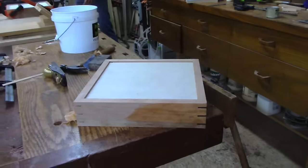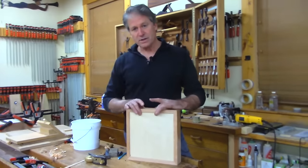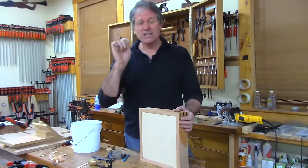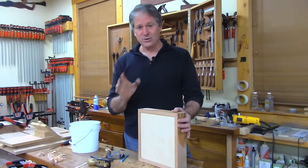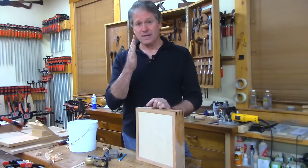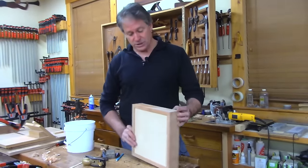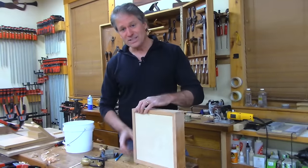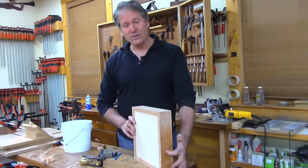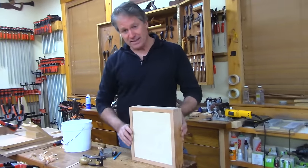Any tips for cutting off the top to make a lid? A lot of times I do that cut on the table saw. I set the height of the blade so it's just shy of cutting through — you can check that with a test piece. Make sure it's coming up but not quite penetrating all the way through the thickness of your sides. You make one cut, two, three — and when you get to that fourth cut, if you'd sawn all the way through, you've got a shaky situation and it's really hard not to squeeze on the blade. By not going all the way through, even though it's thin, it gives you the rigidity to make that final cut.